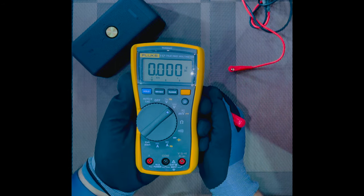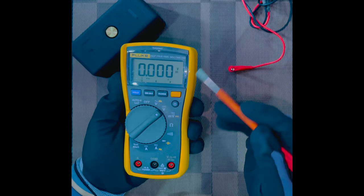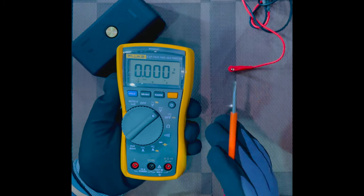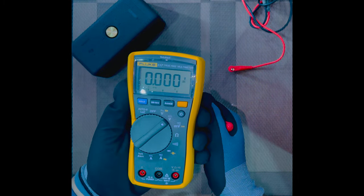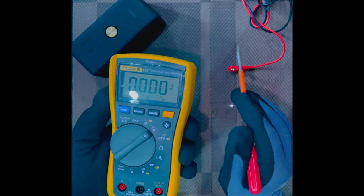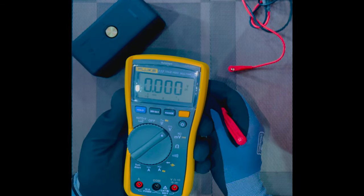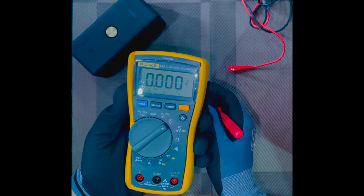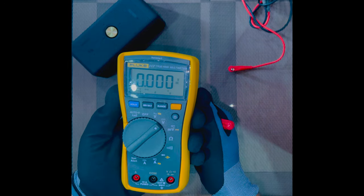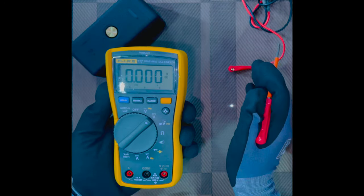Now this type of mode is most commonly used where we have DC voltage, such as PLC equipment or solenoid supplies, where the equipment is battery powered, or in signal applications, most commonly 4 to 20 milliamp transmitters, loops for analog signals, and also in digital signals where the equipment is looking for voltage to be present or not to determine the input state. So the most common DC voltages that we see in our daily life onboard ships are 5 volt, 12 volt, 24 volt, 110 volt DC supplies.